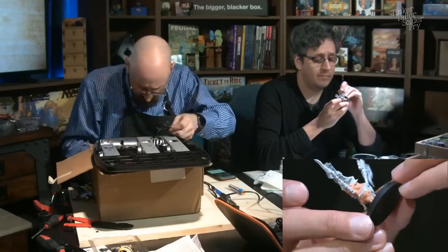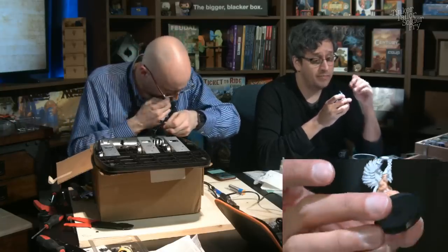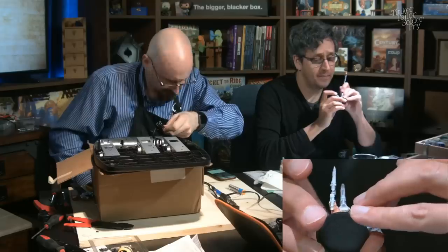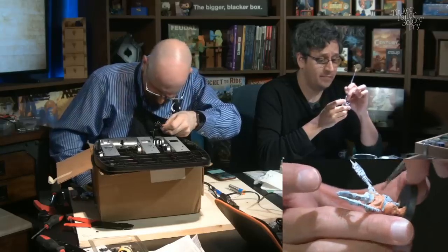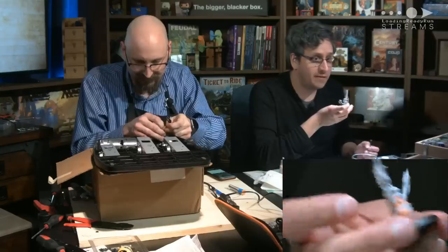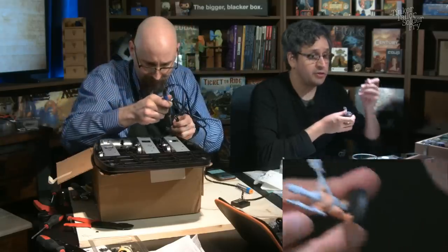Red goes to... Okay, so green to gold. The most overlooked step typically in miniature preparation is not the priming, it's washing the plastic before priming. Because plastic, when it comes out of the mold, has a thin film of release agent, so that the plastic doesn't stick to the mold and comes out easily. Like you grease a cake pan. Similarly, you grease a mold, or at least you used to. So you take your new plastic sprue to the kitchen sink. Jesus, Smash, that's amazing. It's a fine looking miniature. And you wash it with just detergent.